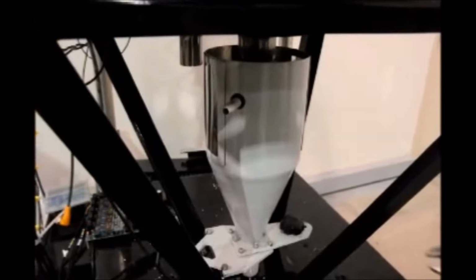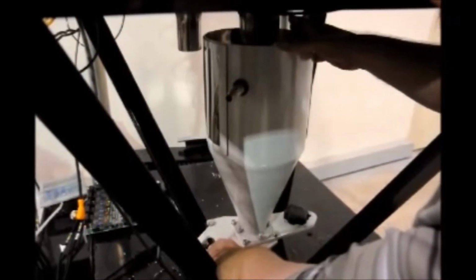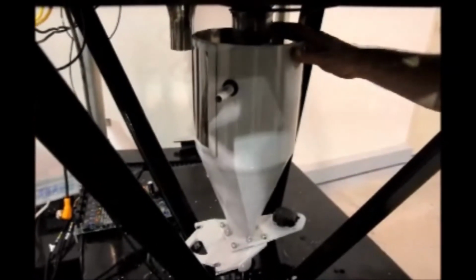Then using a wrench, I need to open up the two bolts here that hold the downcomer in place. They are 13mm bolts. Place the bolts in a safe place so they do not fall down the extruder throat. Once you have the bolts out, you just simply lift the downcomer from the load cell very carefully and remove it from the blender. To put it back in place, do just the opposite. Set the downcomer carefully onto the load cell and replace your bolts.